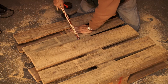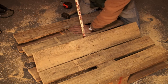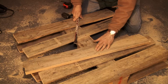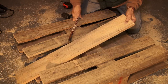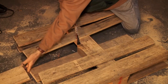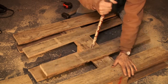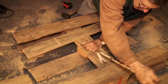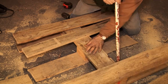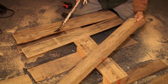Drive it underneath and then just lift it one way or the other. That's off. And it's pulled those nails out clean there. And the wood is a really nice hard piece of wood. Just put that off to a side and make sure you put it nail side down. Put the nails down, you're going to be walking around. Lever from that bottom end, because this piece is going to be my nice flat surface I'm going to sand